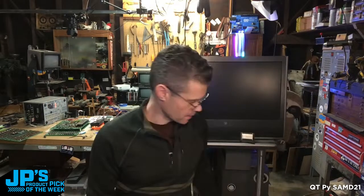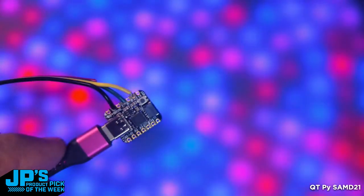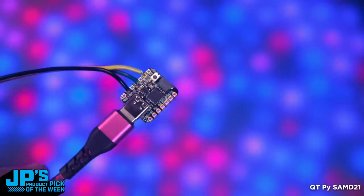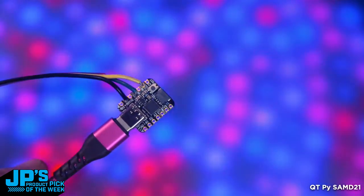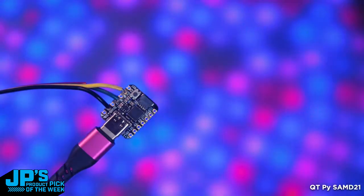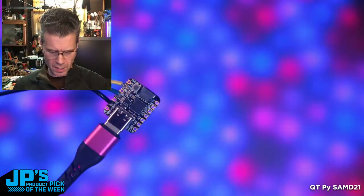Here's a nice little demo I've got set up of some of the power of the board here. I'm going to reset this and switch over. Pull a camera out here. Give us some focus. Got some nice soft focus going there. So here's an example of a project where I have a really large number of NeoPixel LEDs being driven by our little friend, the M0. Let me get that board stable there. In this case, I've soldered some wires to it, so you could do this sort of thing over Stemma QT, but I just went for direct soldering to the data in and ground on the board.